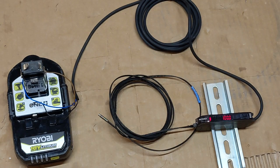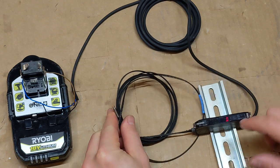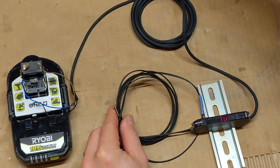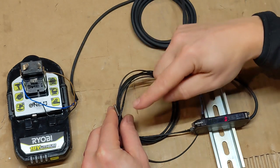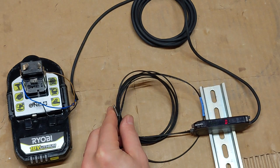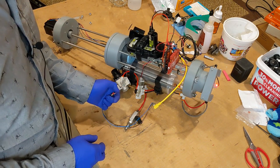One super cool thing I'm going to use here is this little fiber optic proximity sensor. You can see there's a beam coming out and a return line as well, and whenever it notices something in its path it measures the light coming back — so if I get further away it starts dropping, then adjusts as I get closer. Since I don't care about the exact distance and just want to know if there's cookie dough there or not, I can use this as a basic presence sensor.